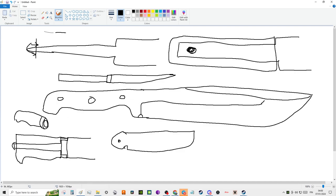So what I do here is I push this forwards, and I've been avoiding using pins because what happens on wood, especially, is if you have a pin, these forces that are going up and down from batoning and chopping, what happens is this tang wants to force its way through the wood like a wedge. It's trying to split its way down, and often what you see, especially if you have multiple pins in a row, you will see a crack developing here or a crack developing all the way here. And the ring is the only thing holding the handle in place. And I've showed a lot of examples like this in my videos, but the handle is still totally functional, right?